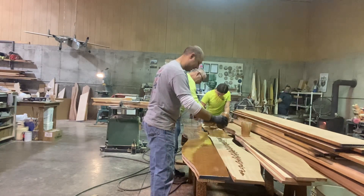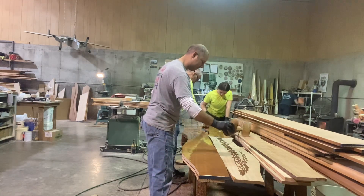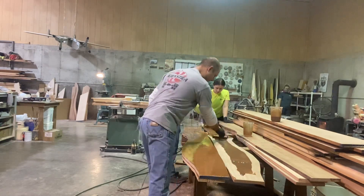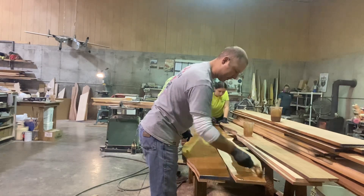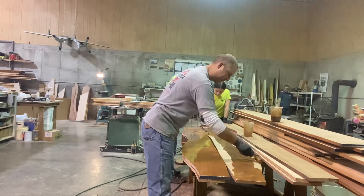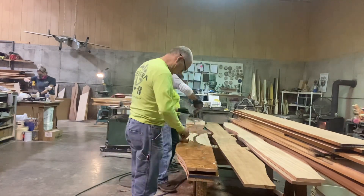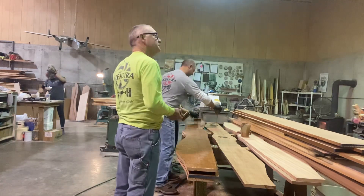A four-inch hub thickness is the equivalent of six laminates, which is a big deal. My open time for my glue is only about 20 minutes, so to glue up six laminations of a prop this big in 20 minutes meant I needed help. I got my husband, my daughter, and my dad — three generations gluing this prop up, which is pretty cool. I mixed glue while they spread glue, and even though I got a head start I still couldn't keep up with them.